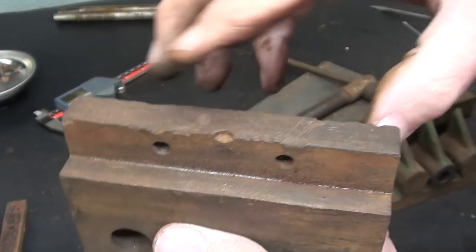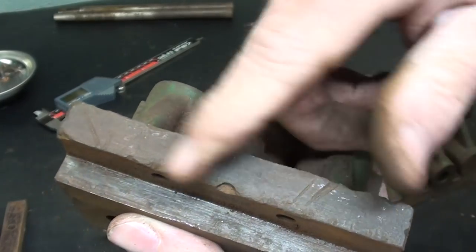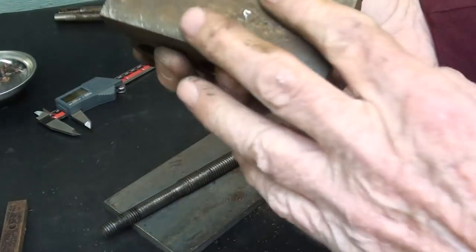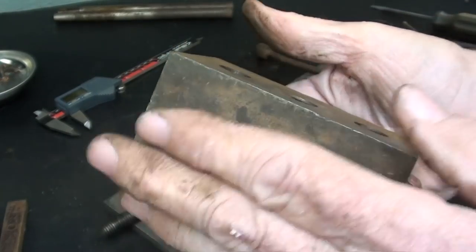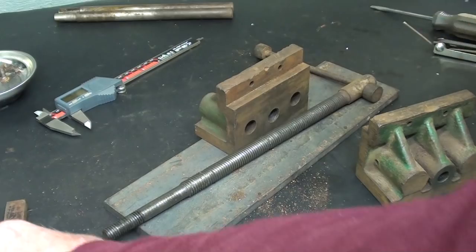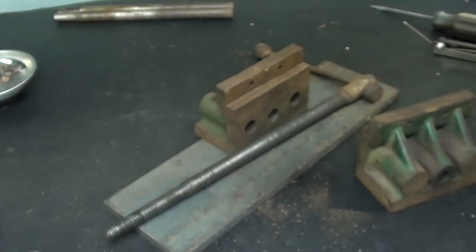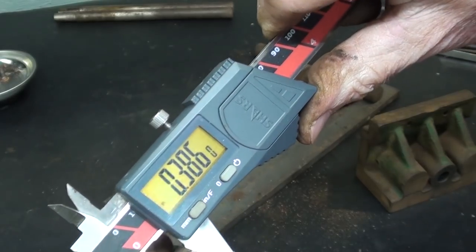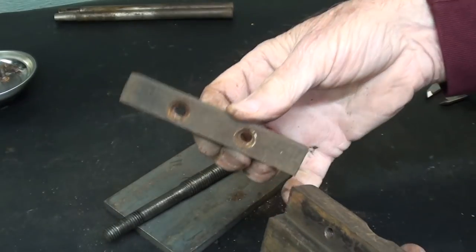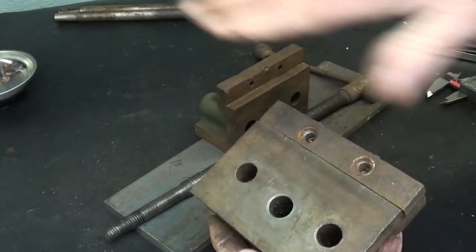Several observations as I clean this up: there's the usual damage you see on the top of a vise jaw, which doesn't surprise me. But there is welding spatter here and spatter here probably from the ground wherever it sat. I'm going to take this to the abrasive machine and just clean these surfaces up, because this won't even sit flat. Also, these two vise jaws are not the same thickness — that one's 0.359 and that one's 0.386. So later on I'll either mill these to a different dimension or mill new stock that will fit, then face the whole thing off so it's all one clean surface.